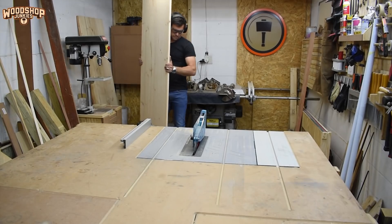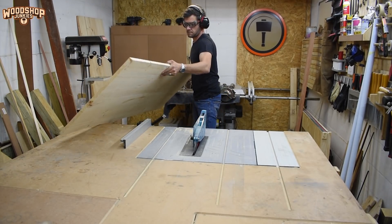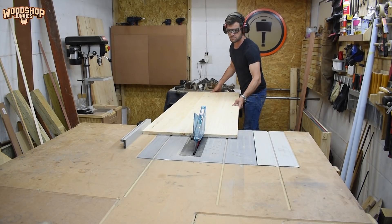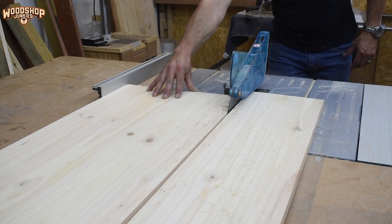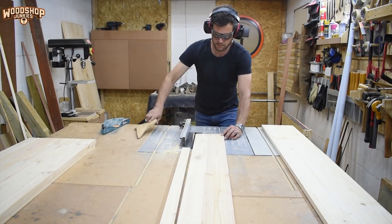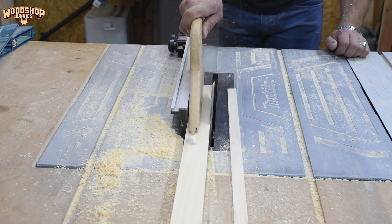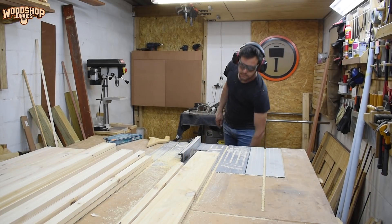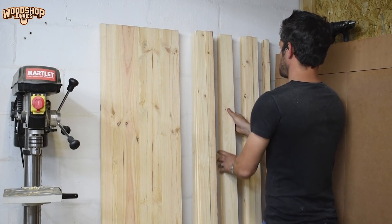Using 19mm or ¾ inch laminated pine boards, which come in a variety of sizes, eliminated the need for glue-ups and also the need for a jointer, which is a tool that the average hobbyist doesn't own. Instead, using a table saw or even a circular saw to rip up the board into the variety of widths required to make the components of the rack was the first step. Staying with simplicity, I designed this cabinet to only require one of five widths of planks, with the exception of one — but I will get to that in a moment. This also has the added advantage of only having to readjust the table saw fence a handful of times.